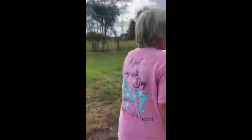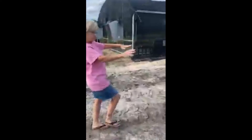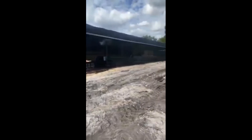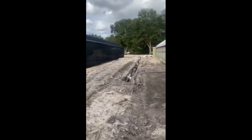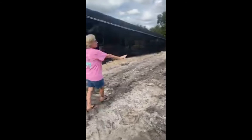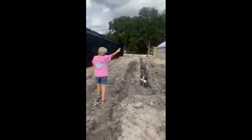Come on outside — we're going to look at the rest of the drainage system. Normally this area when it rains would be really full of water and we tried several things, but the French drain system works the best. We just have to fill in with the rock and then cover over. We leave a slant to the center and bring the plastic from the greenhouse towards the center so it draws all the water to the center, then it goes through a six-inch pipe and out to the pond.